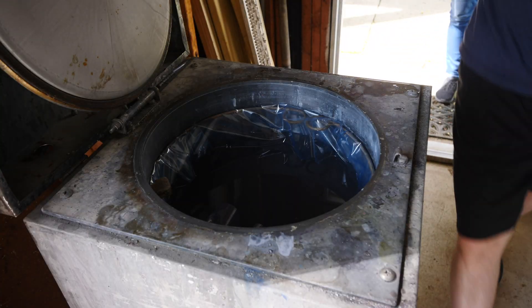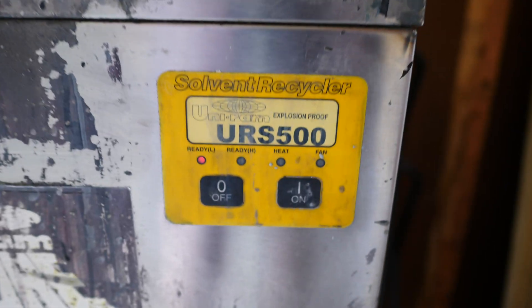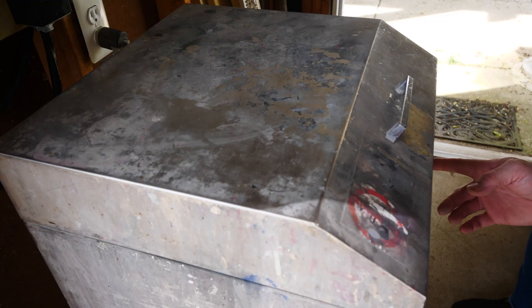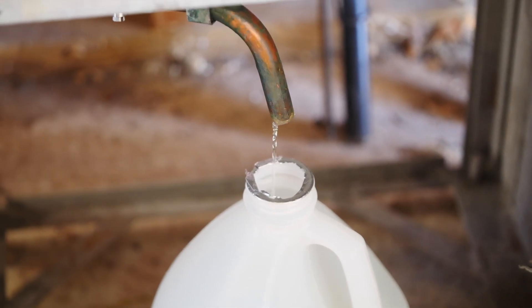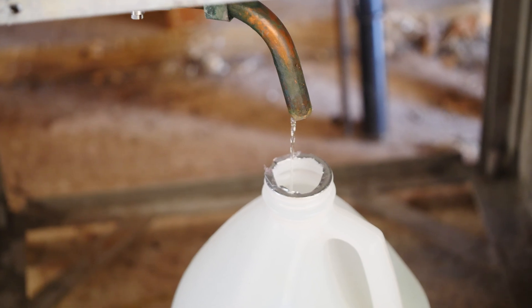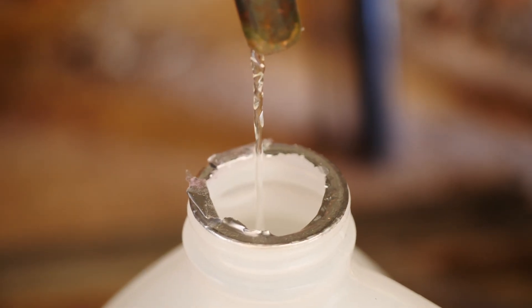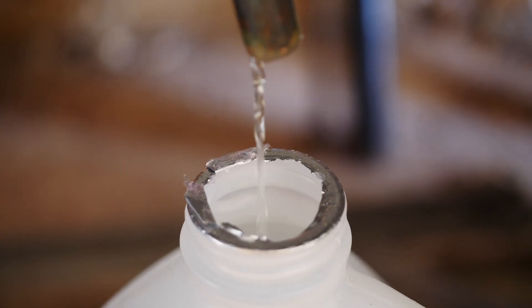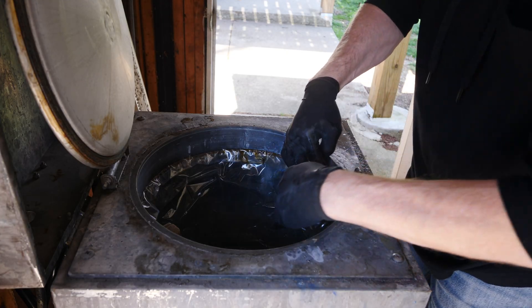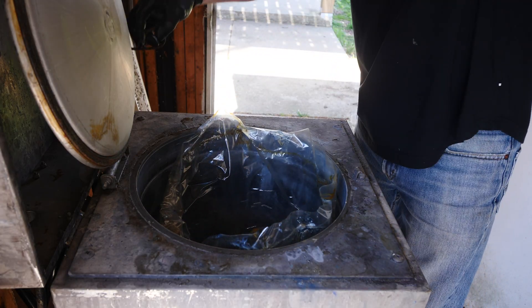You put a plastic liner in there, close the lid and top, and set the temperature — there are three temperatures and I set it to the lowest one. Hit start and the machine runs. It takes about four or five hours, and look at that: nice clean IPA coming out of the solvent recycler. I have it going into a one-gallon jug so you can see it's nice and clean. Normally we fill up the five-gallon tank using a five-gallon metal closed-lid bucket, and we recycle five gallons at a time.